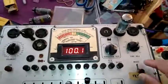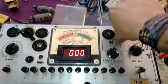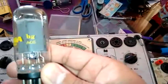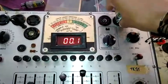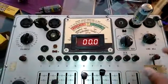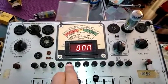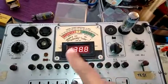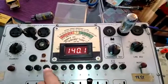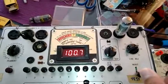After this, you must put the merit button to off in normal position, reset all the buttons, and we can go to the next tube to test. Now the next tube to test — I put it in as number 2 — and we will do the same as with the prior tube. Again, we test pins 3, 4, 5. As you see, it goes immediately up to full. When I push the leak test, it goes to zero. Moving to button number 3 — merit test — you see it's almost similar to tube number 1.